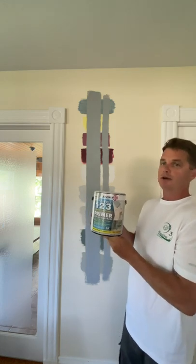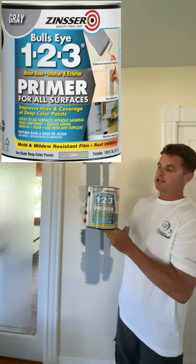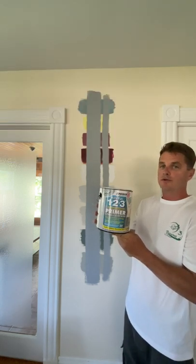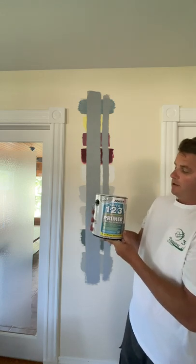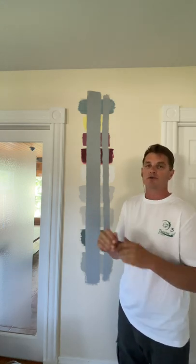After the second coat — both rolled and cut in with the brush — you can see how the Zinsser BullsEye 1-2-3 gray tint base covers in one and two coats over the various colors on the wall. This stuff dries to just shy of an eggshell sheen, so your top coat is going to slide right on top. For the price — around $25 to $30 a can — it's great, and it comes with a factory gray tint so you don't need to mess around finding the right color gray.